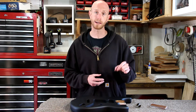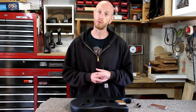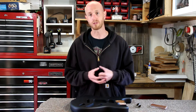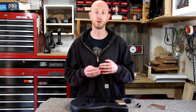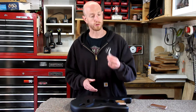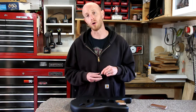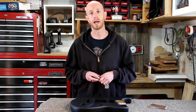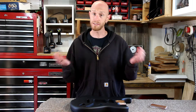If you've seen my speaker shelf build, remember when I built it I routed a groove in the back that the wire passes up through, but I didn't account for the mounting hole running right through that groove. When I went to mount it on the wall, I just didn't have quite enough room for that wire to have enough clearance between the mounting screw and the edge of the groove. All I did to fix that was take a Forstner bit and drill a little recess around that mounting hole on the backside, and that gave it just enough room for the wire to move out of the way so the screw could go into the wall.